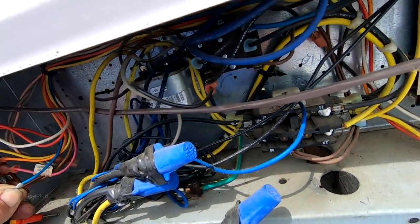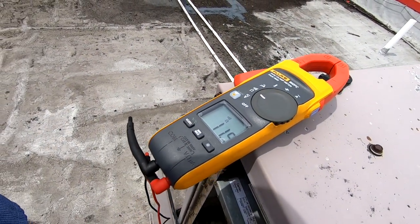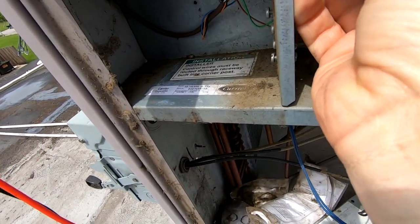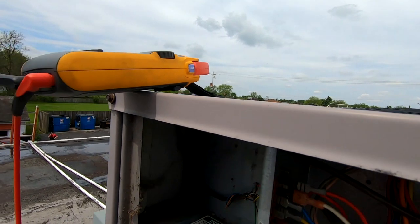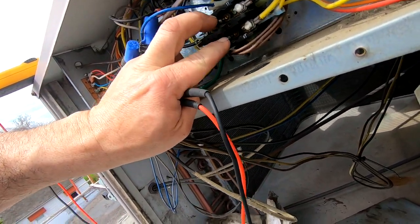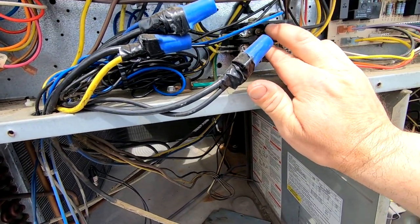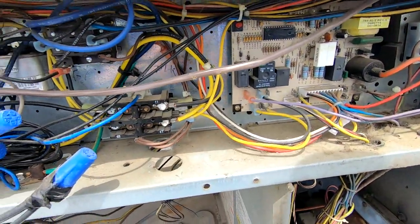After connecting back and rechecking, we're now getting 212 ohms — that's weird. Going back up to Y1 and connecting together, now we have 12 ohms — very odd. That contactor does not shove in very well; it's a little pitted.